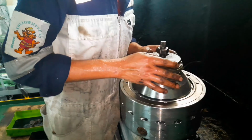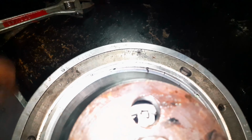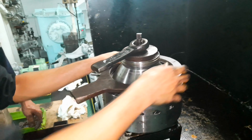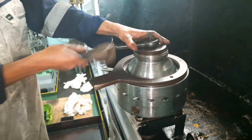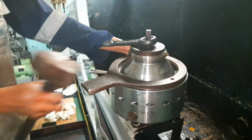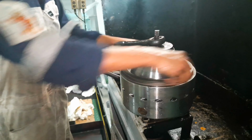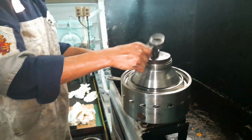Adjust the direction of the peep hole of the disc clamp plate to be able to see the rib of the distributor. Fix the ball nut handle and tighten the disc clamp plate nut until the aforementioned rib is at the same height as the top disc. Then remove the ball nut. Then remove the disc clamp plate.